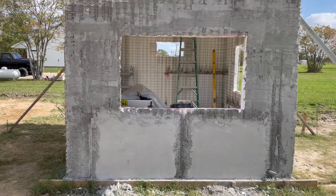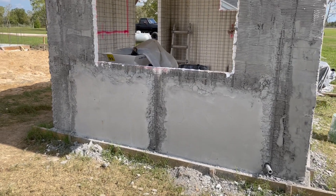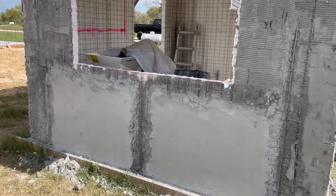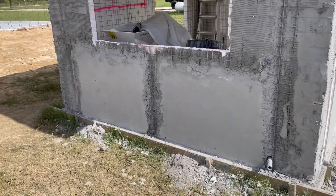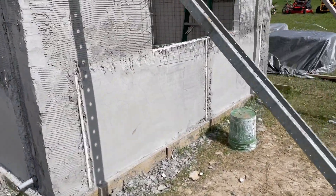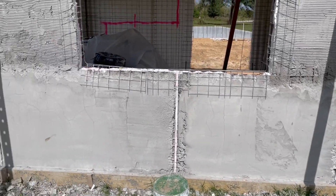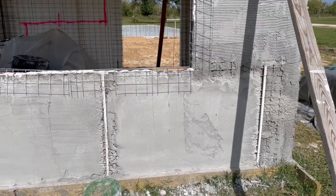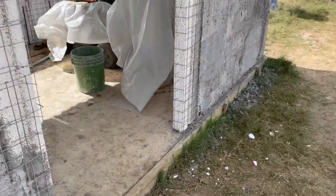So what you see here is just us testing our mortar sprayer machine. This bottom portion is the thickness of the structural coat. We've started, just run a little bit of mortar just to test the machine. You see the little PVC pipes — they're just a gauge to help us get the right thickness on the structural mortar. So those pipes will come off and then we'll fill in the voids when we come back with our structural mortar machine.